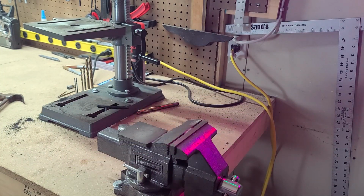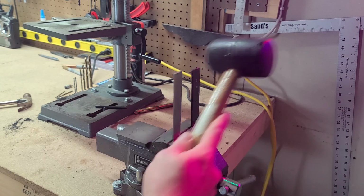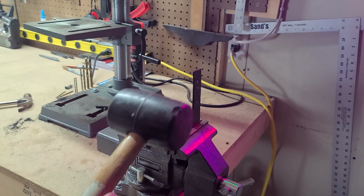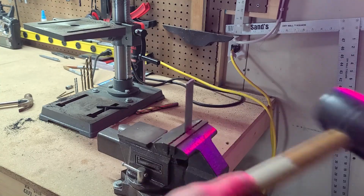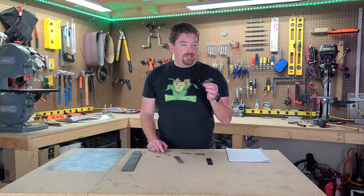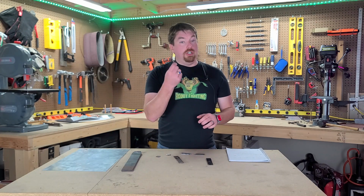So as you could tell, the metal bar that I had that was mild steel bent relatively easily. However, because apparently I had some microfractures within the structure of my 1095, that also snapped the tip off really easily. Now, that was just one side. Once you saw that I locked it in again, it took quite a lot to get it to snap. It required getting a lot of stress on that. So there was a little bit of weakness still in the blade, but you could tell that there was strength in sections. It's a good test.